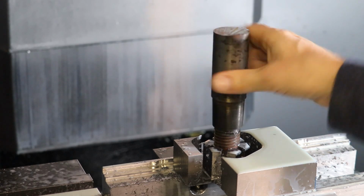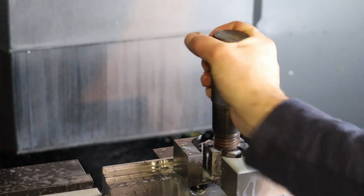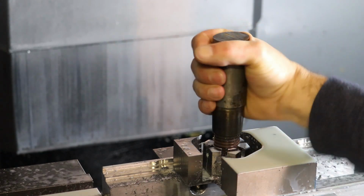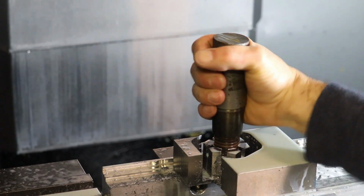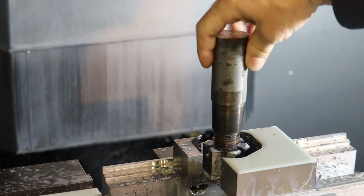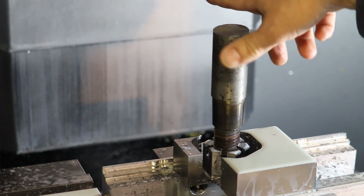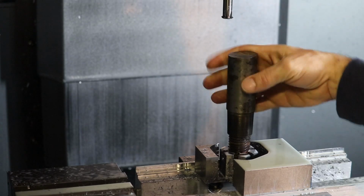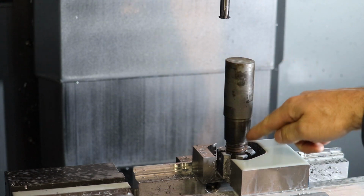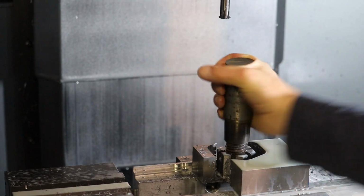No, that feels good. It's pretty tight. There is a little bit of rust on the old shaft here, and we are starting to tighten up a little bit. So the question is, do we increase the height of the thread, or are we bottoming out on the tips of the thread? This tool has infinitely sharp tips on it. So with that 5 thousandths change in height to widen the thread profile in our nut, we almost are on it.